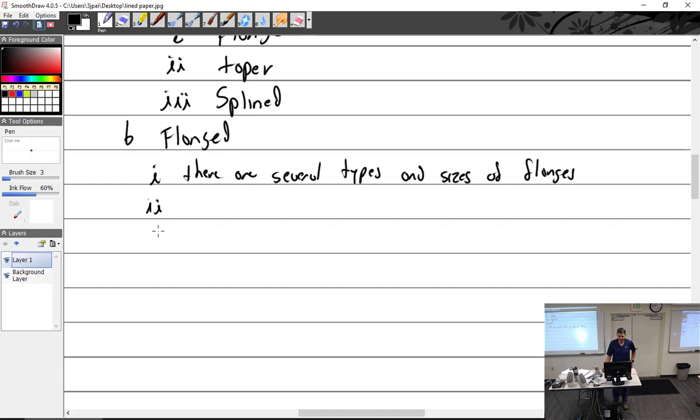So anyway, what was the correct fix? Can't get a new prop, because that crankshaft flange was never designed to go into that engine that went into that aircraft, because that would change the model designation of the aircraft engine. So if you had an O-235-L2C, which is what the 152s took, but you had an O-235, I don't know, N2C, I'm making up numbers, that's the difference, the crankshaft. So you've technically converted the L2C into some other version and then put it on. So you violated the type certificate of the aircraft. And when you go to buy a prop, none of the props that will fit that crankshaft are type certificated to go onto that aircraft, because that aircraft now has an illegal engine. See the line that it creates?